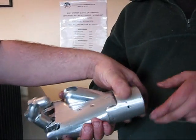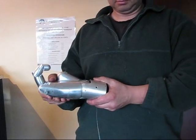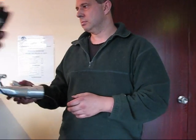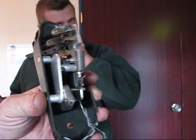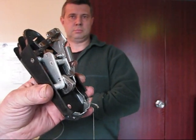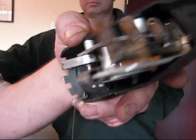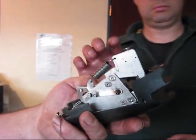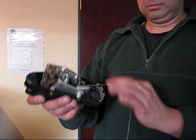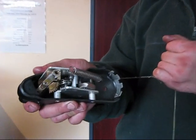Now it has got a moveable wrist. Charles here has worked very very hard on the arm — I'm very proud of him. This is the one in plastic and you can see the mechanism on the side. It's a self-contained aluminium mechanism with its own separate crankshaft and own separate little brass bearings. There's the spring that opens up. It's also got a bell crank to return the fingers to the right position. You can see the working of it there.